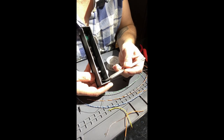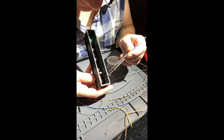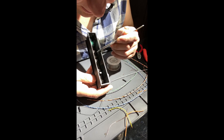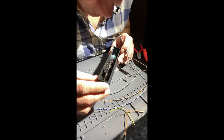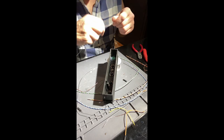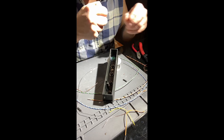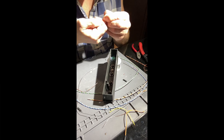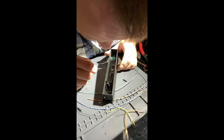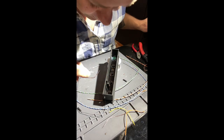Now, the Wemos is going on this side. So, I'm going to end up tying the ground in probably somewhere in here. As far as NeoPixels, it's going to come out of the Wemos, go into my first, onto the inside. Coming out of the outside there, it's going to go into my second NeoPixel. Now, I do also need 5 volts between the two. So, go ahead, set that up. Yeah, I think I'm going to bring the 5 volts over here into the Wemos just to give us some room to pull it out and maneuver with it.